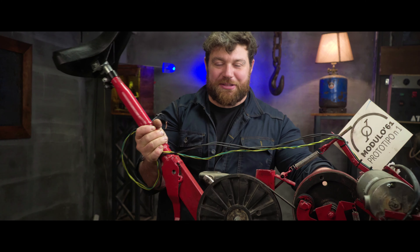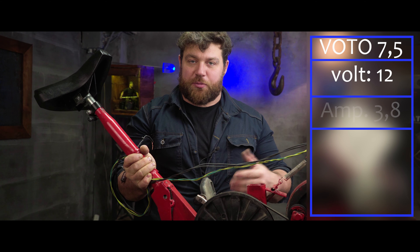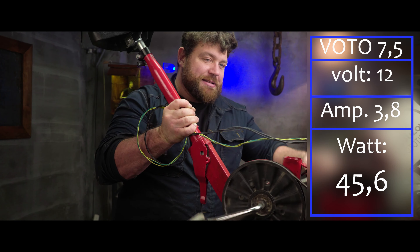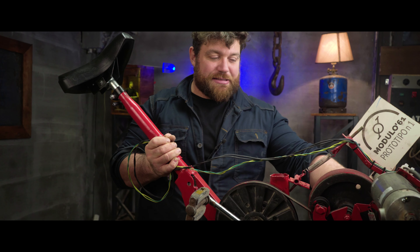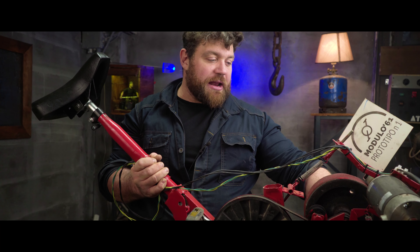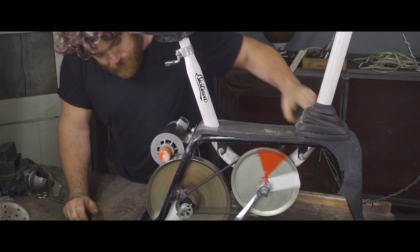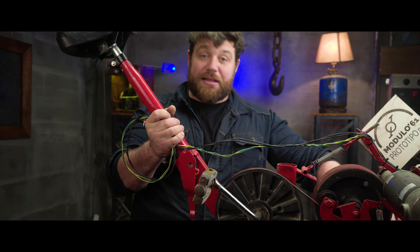Prototype number one! Let's give a vote from one to ten — I will say only a six and a half, even if it's working great, because we are producing 60 watts without problems, the legs aren't getting tired, and it's very good production. However, it's so noisy — you can really hear that it makes so much noise, and this is terrible if you want to use it indoors. It's also very complicated because you have to build something that holds the skateboard wheel. Probably a better idea would be to use a much longer rod from the motor and connect a rubber wheel on top. But overall this works great — we have very good electric production. So let's move to prototype number two.